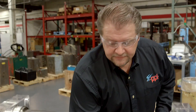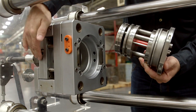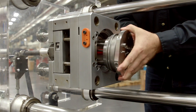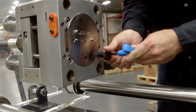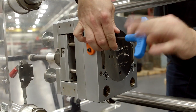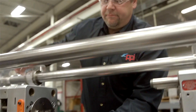To load the Roundmate system you're really only looking at about a 10-minute period of time. Simply take your Roundmate cartridge — you'll see that there are four cams that are going to interlock into these notches on the Roundmate tool, and there are two cams that lock into this slot in the ejector retainer system. We slide the mold in place, grab the tool, and turn the cams into their location. And just that fast you've loaded your B half of your Roundmate tool.